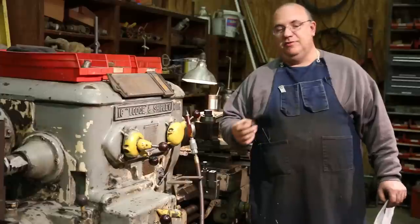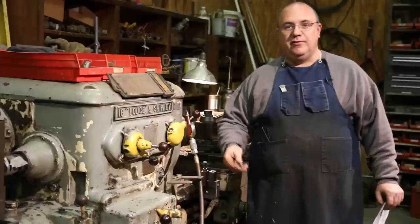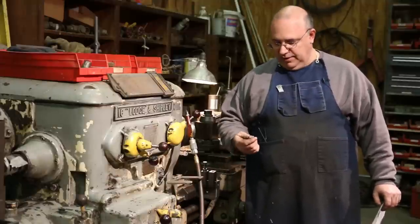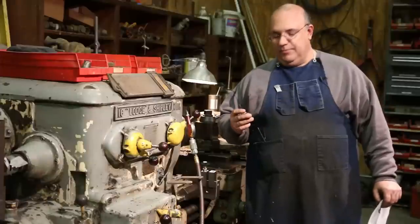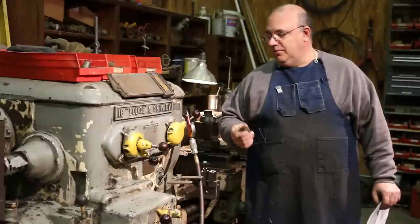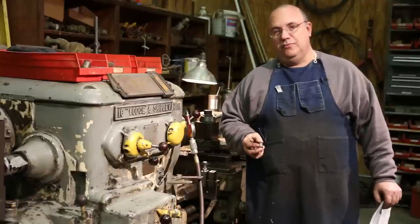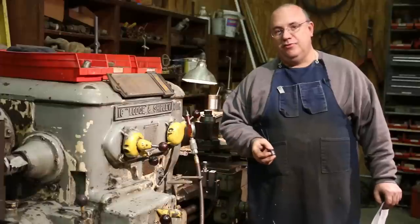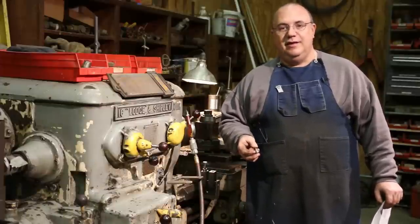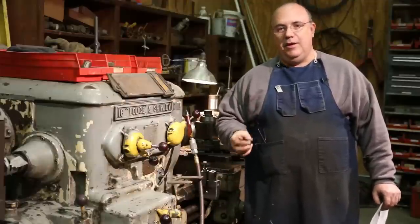And of course, in a commercial machine shop setting, that's what a lot of machine shops do: they crank out hundreds, if not thousands or tens of thousands of the same part over and over again, and have repeatability between parts. Back in the old days, they had special machines for doing production work. Specifically with lathe work, they had turret lathes and screw machines, which were both specialty lathes that could be set up to repeat common tasks over and over and make the same part.